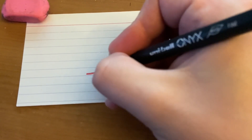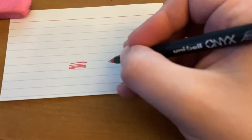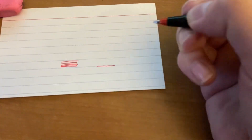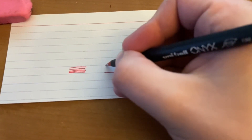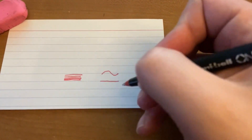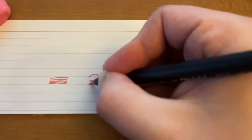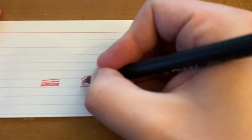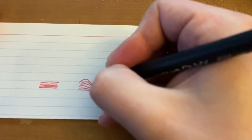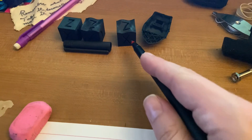Alright Asa, if we're looking at this from a side view, our normal 3D print layers are going to look like this — straight lines. As we print, we do layers of these. But say we're making one of those cubes: we'll start flat because it's on a flat print bed, but when we get up to the top, we want it to look wavy. What we can do is interpolate between these two functions — halfway between flat and fully wavy, it'll be half as wavy. Pretty close to flat near the bottom, and getting wavier as you go up, until you build up the full object. That's pretty much all you have to do to get those funky shapes.